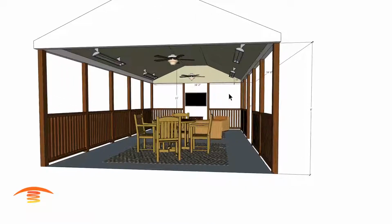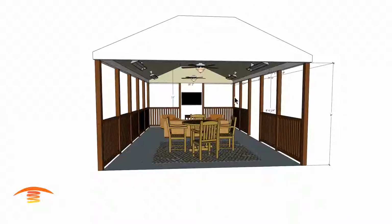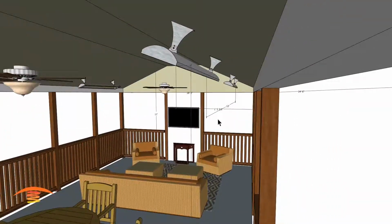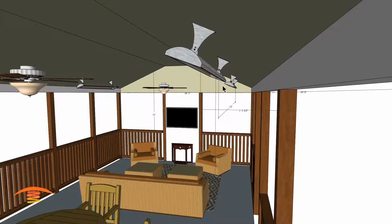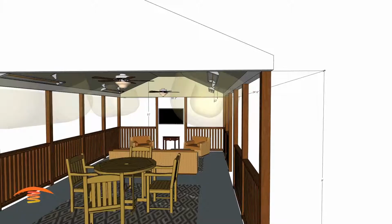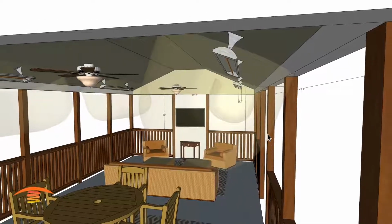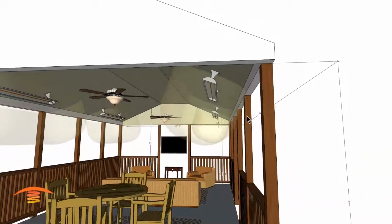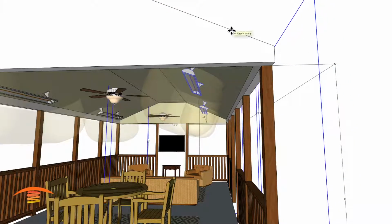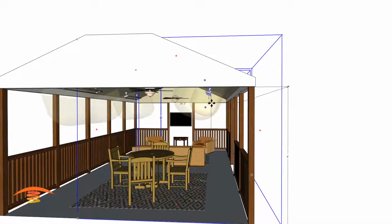Also, I like to have the heaters above the seating position as much as possible, so that the ray itself will be as high as possible and even as possible. So you can see here I have the heater roughly 1 foot 5 5/8 from this edge to this edge. You can see there's the dimension. The reason I have that is because of the clearance below. I'm trying to meet the clearance to these beams, or posts rather. So that's why I have them this close, but you could easily change this and move these heaters slightly more inwards, and then change the degree of the angle.